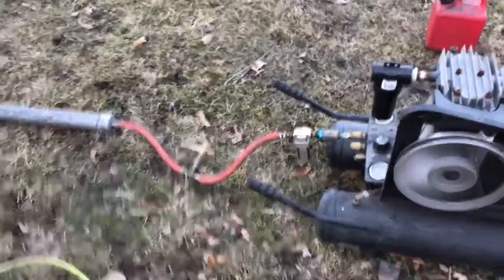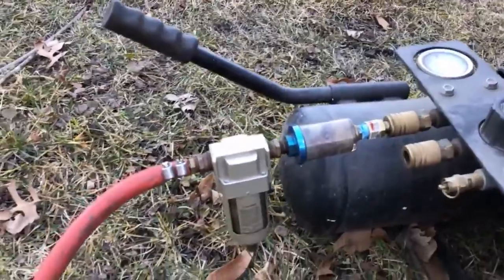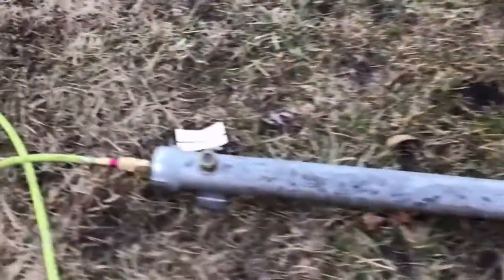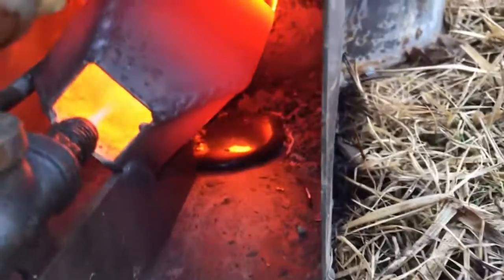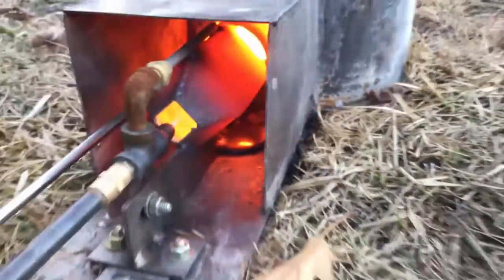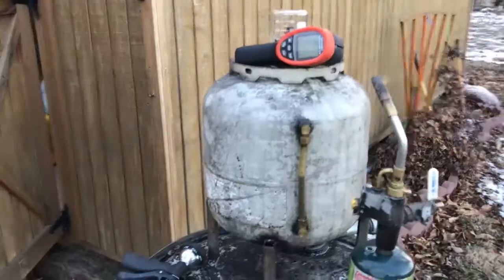If you're striving to get max temp, dry air is absolutely essential. If you've ever watched an air meter you'll see that water is spraying through it constantly, and spraying water into a hot fireball definitely cools things down quite a bit. The last thing we want to do is be spitting water into this thing every couple of seconds, and that's what happens when you start running this.